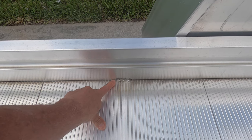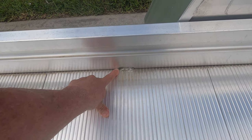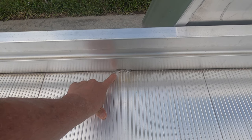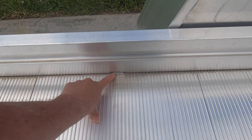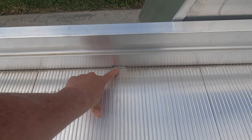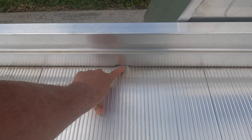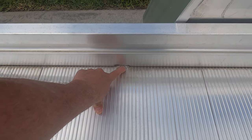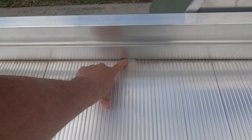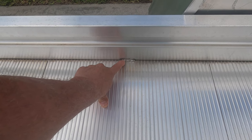My first little nitpick is the welds. It appears that they used a MIG welder instead of TIG welding. TIG welding would be the preferred method for welding aluminum. The welds here along the deck to the sidewall — they just tacked it in with a real small weld. The weld itself is probably functional and will probably hold, but it's not the best looking weld, and some of them have some pitting in them.